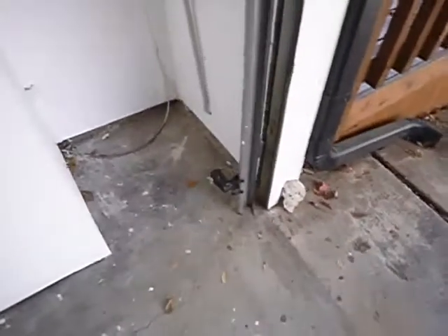This is the garage overhead door and stuff. The receptacle outlet here is bootlegged — the wire goes under here, comes out over here, comes up to here. This receptacle outlet is bootlegged.